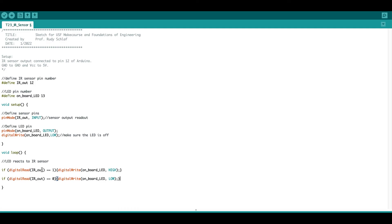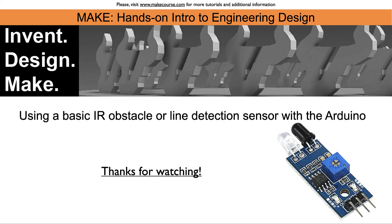If the infrared output pin is 0 volts, logically 0, then I turn the LED off. Remember, the infrared sensor puts out a 1 if it doesn't detect anything, and a 0 if it detects something. So the LED on the infrared sensor board turns on when something is detected, but the LED on the Arduino board turns off — giving us that ping-pong effect. This concludes my demonstration of the infrared sensor. Thanks for watching, I hope you enjoyed it.